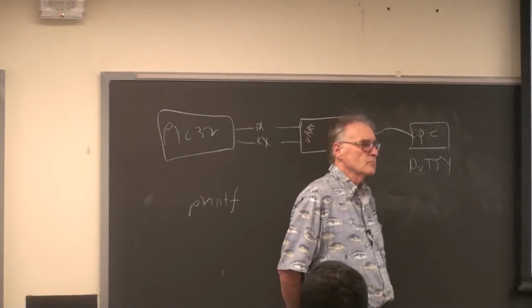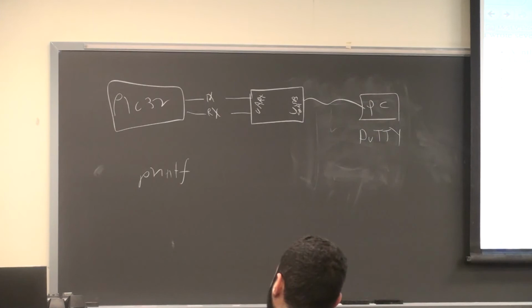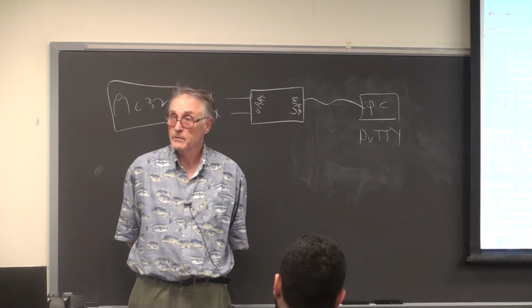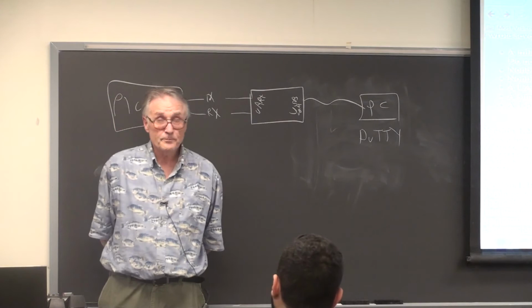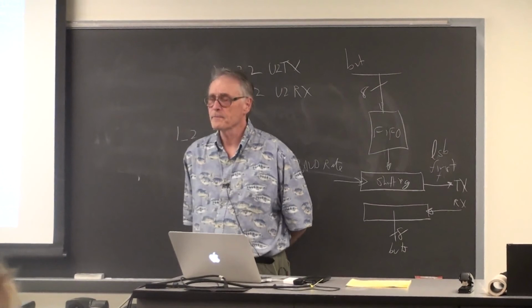So any questions about this? The question is, are the old lab codes compatible? If you used RA1 for anything, you'll have to remap my receive pin to another pin. I chose RA1 because I didn't use it in my example. If you used RA1 for something like a button in lab 4, or for reading an analog conversion, then you'll have to choose another I/O line and modify the ProtoThreads header to account for the reuse.